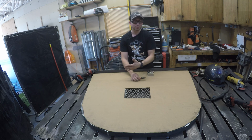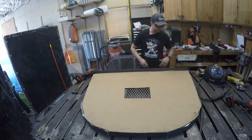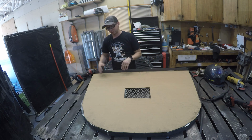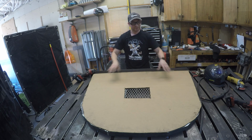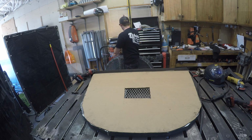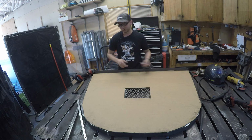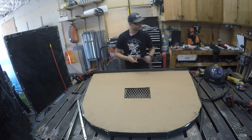I could go into CAD if I wanted to, and start figuring out what that form is. I could also use some pieces of scrap that I've got floating around. I like having longer pieces, and I could bring them to my window well, lay them out on that intersection pattern, lay them all down, scoot them all out to where they fit around, and then start taking the dimensions. If I had a couple pieces of tubing, I would lay them on the side, measure out to those pieces of tube, and figure out how long they needed to be. If I was using angle iron already, I could easily mark where it needed to be cut and bent. And then you could get that perimeter.